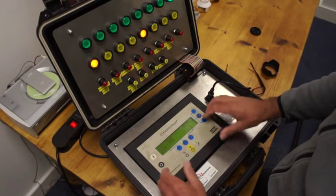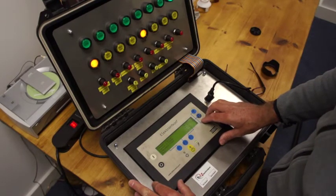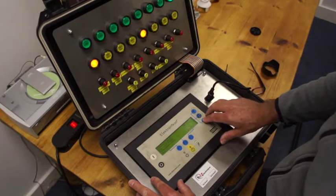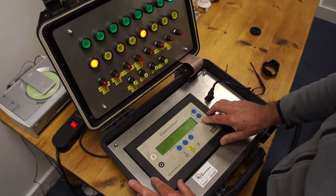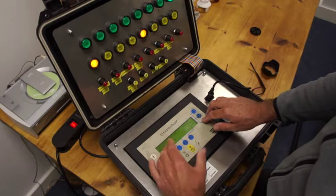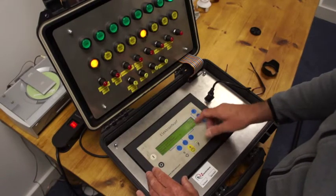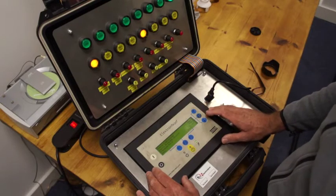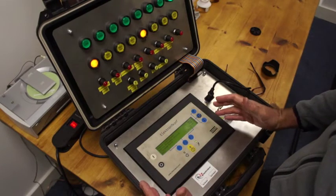Compressor outlet is 45°C — perfect. Element 1 outlet, that's the LP outlet, is 172 degrees — again fine, a little bit cool but I can adjust that. Element 2 inlet is 35–40 degrees, quite normal after the intercooler. Element 2 outlet I've set at 160 degrees — absolutely fine. Compressor water temp is 47 degrees outlet, and then you have the aftercooler water temperature outlet. Then you go on to emergency stop, remote start/stop, remote load/unload, etc. If this were an MD dryer model it would have all the MD measurements in measured data.